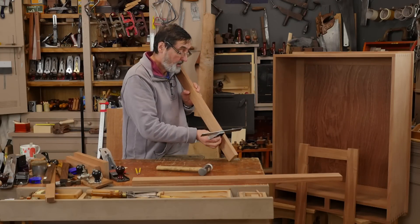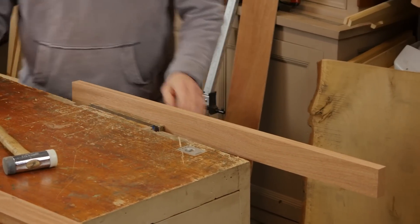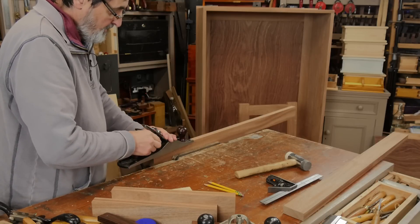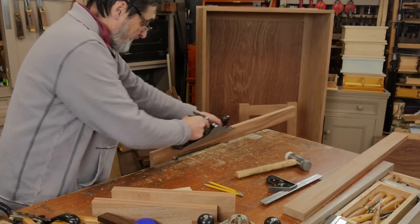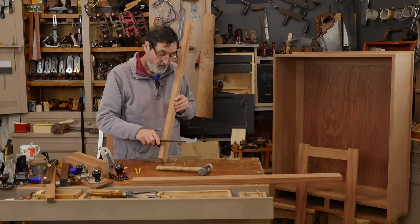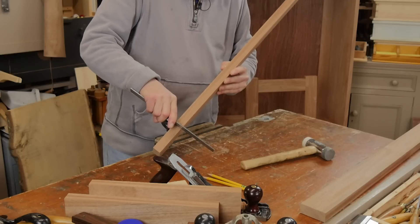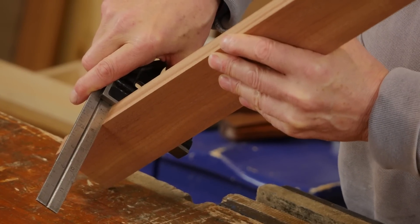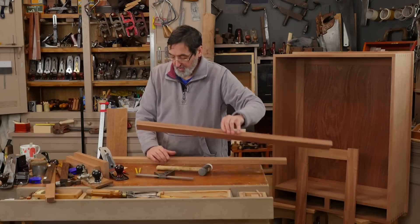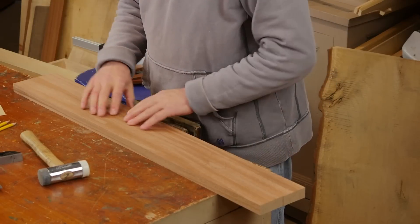That's probably all that I want to get from the surface of this wood to guarantee I'm parallel. It was a very, very small amount. I want it dead on, and that's what I have. Now I'll do my assessment and check, because everything lines up with this face when I use my mortise guide. Now I'm going to check the edge again - in theory the planing changed that edge as well, so I'm taking off a shaving on this edge here just to bring me to square. This is important - this is where the shoulders of the tenon come together on those two outer edges. They have to be square. Now check these two faces along this edge to make sure these are also together, and they're good. My wood is prepared.